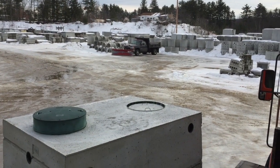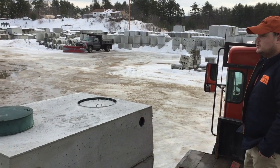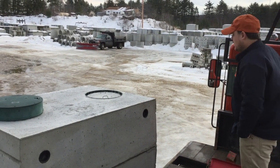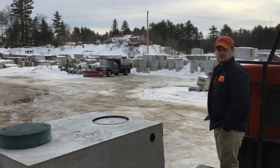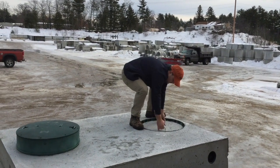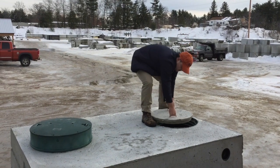This shows the top of our tank. Because it's a single compartment tank, it has two covers on top — one is the inlet and the other is the outlet. On this particular one, we have a plastic riser and cover built into the top of the tank so you can bring it up to grade as a watertight connection. We have two handles so we can easily pick up the cover. It has a taper to it and you put it back down in.